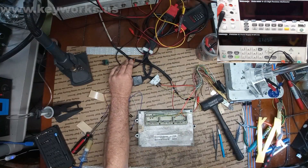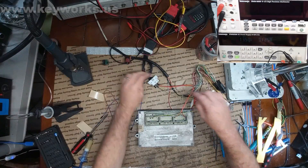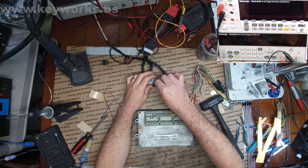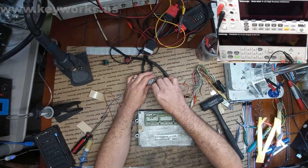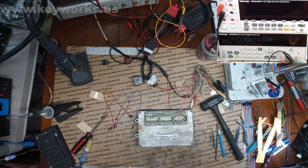I've got it hooked up. I'm going to turn my ignition on and power it up. Now the ignition would be on, and I see we only have about 200 milliamps — that's not right. Usually it should be about 320 to 350 milliamps, something like that. So yeah, that's not right.